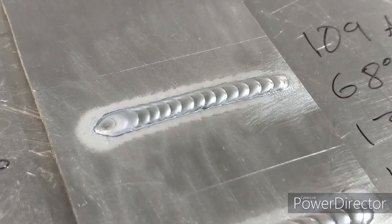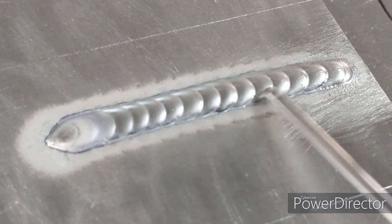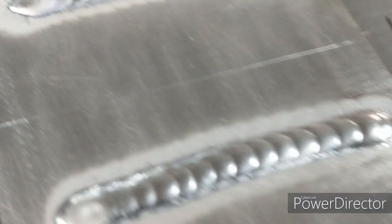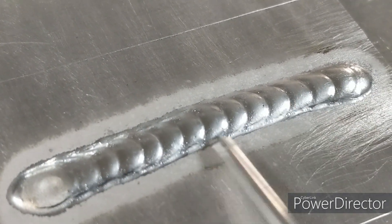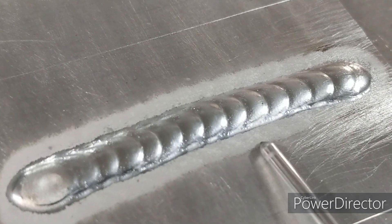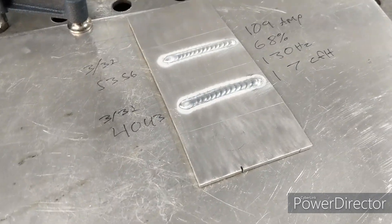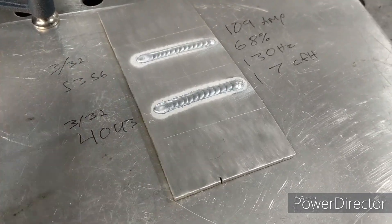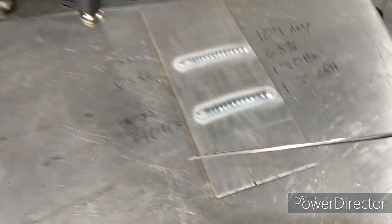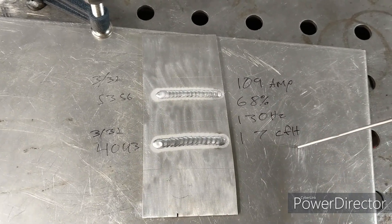Another nice thing is you can see this is pretty nice, pretty relatively free of any kind of imperfections. But if we move to this one, it looks nice from back there — you roll up on it, it's got all these little speckles and marks in it. I do weld a lot of things with 4043, and there are times when that never happens. I guess it's so minute that you'd never notice it. But on the type of stuff we do mostly for automotive — eighth inch and down — you can really start to see that.